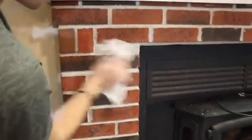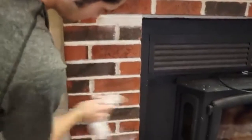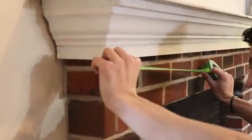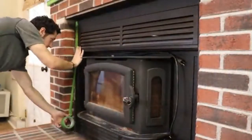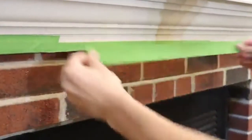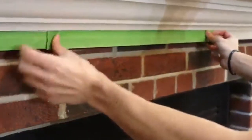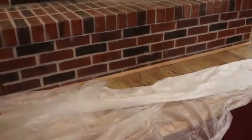After cleaning, take a damp cloth and wipe up any soap residue from the bricks. Make sure it's completely dry and then vacuum again if needed. Tape off your mantle, walls, and fireplace insert, as well as any other areas that you do not want paint. We recommend applying two to three rows of tape for full protection. Protect the floor by covering it with the included drop cloth.